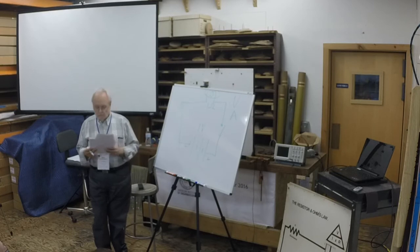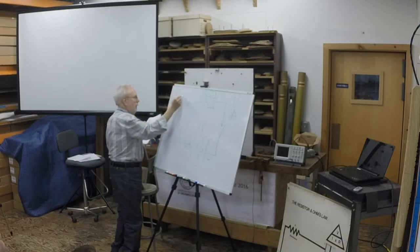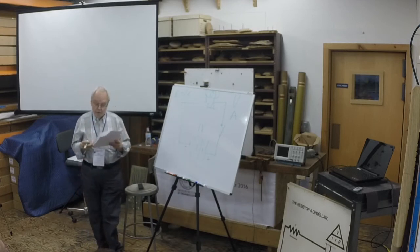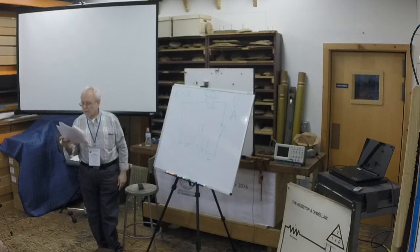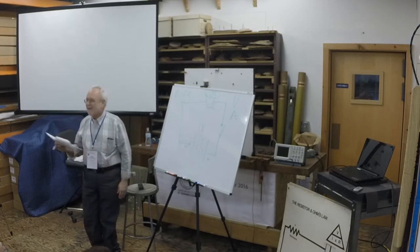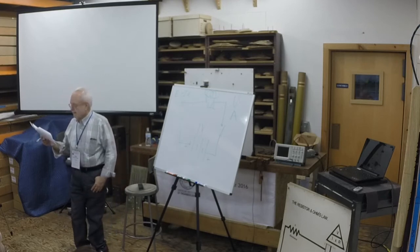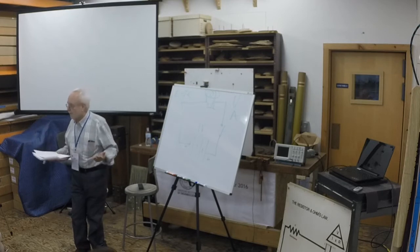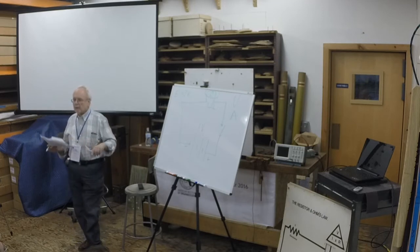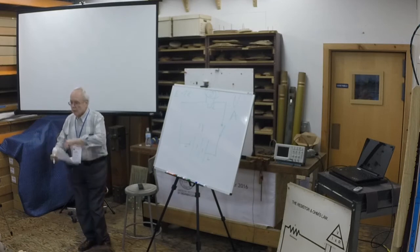Generally you'll see Ohm's law written E equals I R. And what's E? I've got a V there. The E stands, I think, for electromotive force, and the I stands for amps, current flow. Thank God, R stands for resistance. The one friendly thing in all of this. Resistance is simply the resistance to the flow of electricity. I know it's not kosher to define something by itself, but I don't know how to explain it. Maybe we should go back to the plumbing example of that garden hose up here. If you stomp on it, you're providing resistance to the flow of electricity, or if you tie it in a knot.